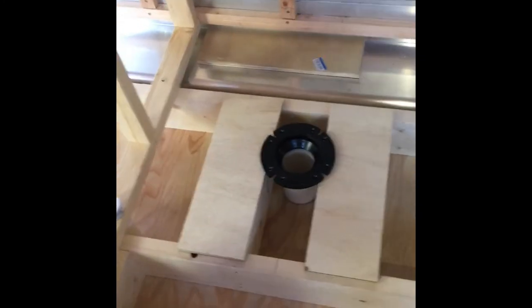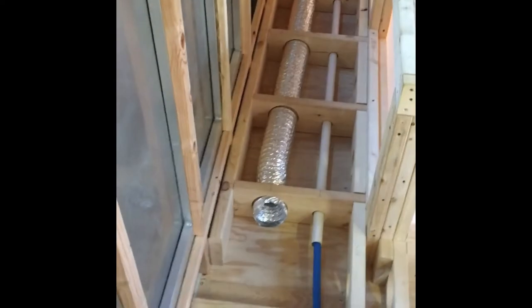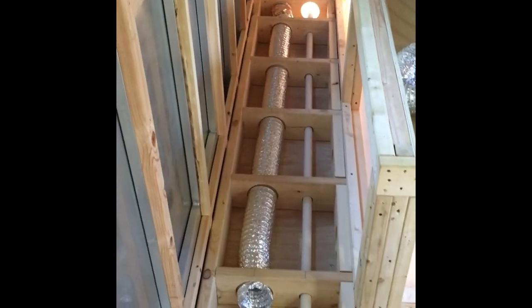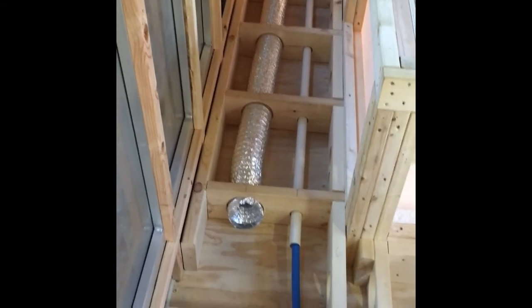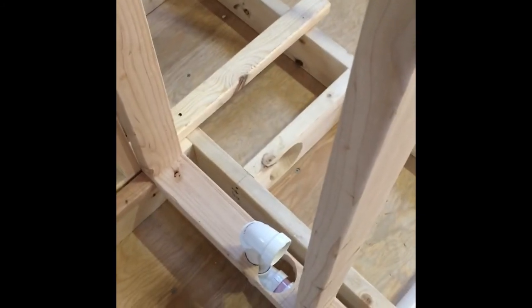Good morning again. I just drilled the hole for the toilet, the vent is done, the shower drain is done and stubbed in, ready to go. Now I'm starting the main water line. That little run right there is inside of a pipe — just felt like doing it. This blue line will run to here, continue on, and go over to the hot water tank. Since it's cold water I'm just going to tee it right there to supply my shower and my vanity, and I may even run it over to the cold connection on the kitchen sink.